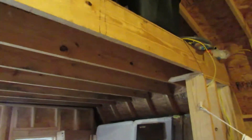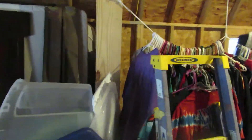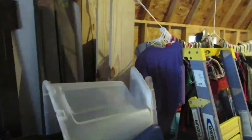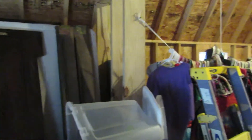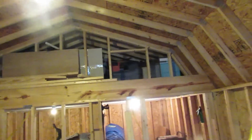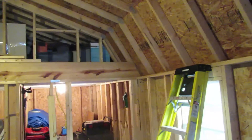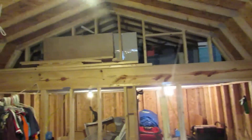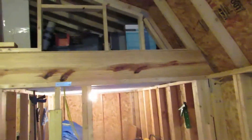The inside's a mess. We've got to get our shed twisted around and jacked up, and then I can get most of this stuff out of here. But over here where I've got my tools is going to be the bathroom. Up top, we added two more joists, which got me 32 inches to bring it out. I did the same thing above the kitchen because I wanted it to be big enough to have counter and a refrigerator. I used two-by-eights where I put my breaker box because you can't do it on the outside walls — there's not enough space. So I went and divided the kitchen up a little bit from the living room, and that's where the refrigerator is going to sit. It worked out good.